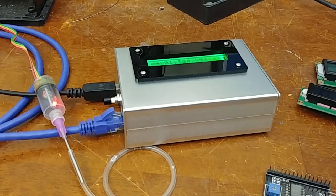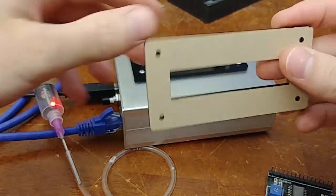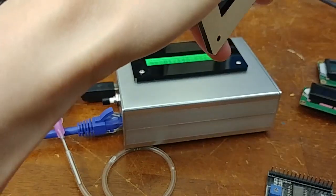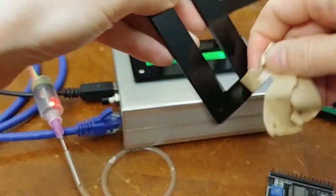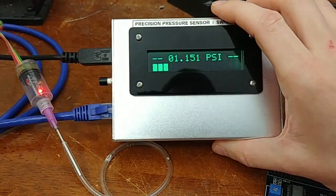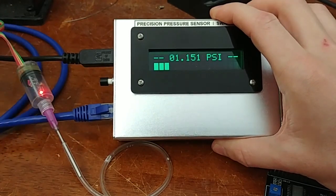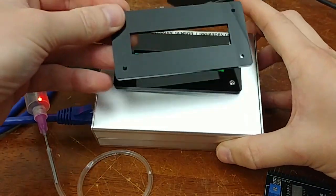These are little bezels for the LCD display — they make it look so nice and professional to mount a character LCD on a panel. It's just a pre-cut piece of acrylic, and the kit comes with little mounting screws. You make a square cut in your metal or plastic panel with a nibbler — it doesn't even have to be a perfect square. Mounting LCDs can be difficult; I've had old projects where really clever electronics looked terrible just because the LCD mounting quality wasn't on point. These bezels really make a difference.